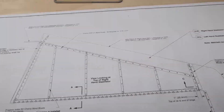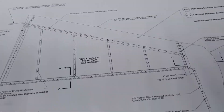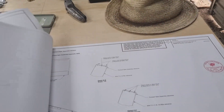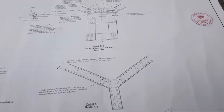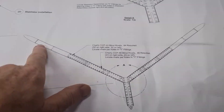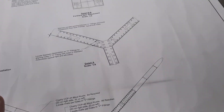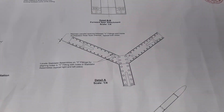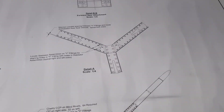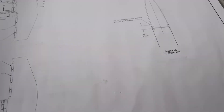I'll just quickly show you — I'll go through a couple of things on the drawing. This is a plan view of the right-hand stabilator, showing a spar detail here. Going back to another drawing showing the aft end of the build — this is the prominent Y-tail, or YX as it's termed. Three spars by the looks of things: a main spar, a secondary spar, and a little plate that attaches to the two spars and back into the aft end of the aeroplane around the tail wheel section. I'll go through those in more detail as I build.